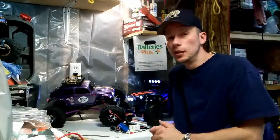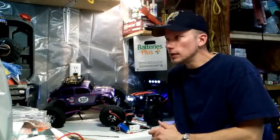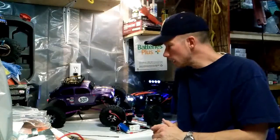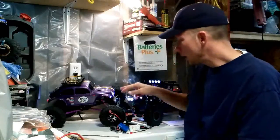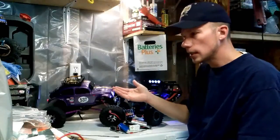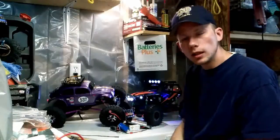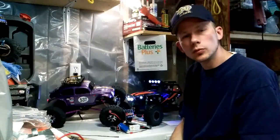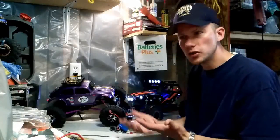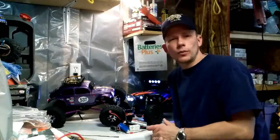About 150 milliamps is not going to quite do it, because I like a little bit of run time in the dark with LED lights. Most LED lights that come with trucks, or light kits you buy — the individual bulbs — most of them require around 6 volts to operate, and some are 4.5 volts.